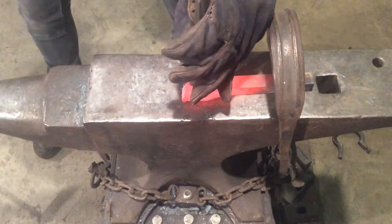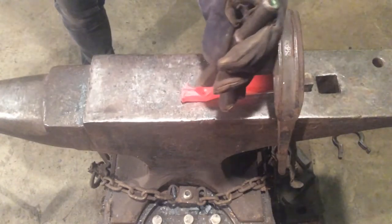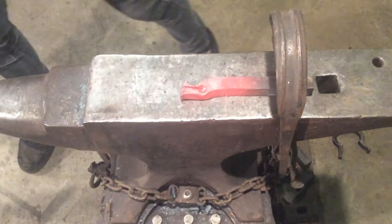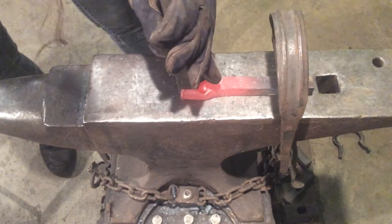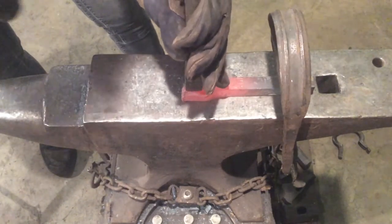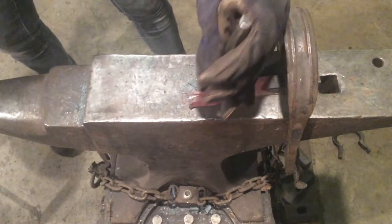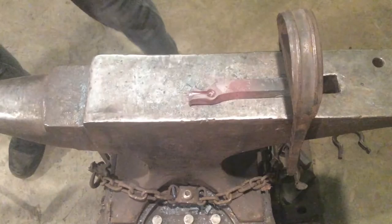Nice and big. So now we can take our cutter again and move that forward. This should be the last time we're working this side — we'll do one touch of heat on the other side. I'll come back with my butcher and re-establish these teeth. Put a couple more pushes on that jawline. You can see that material really wants to move wider.